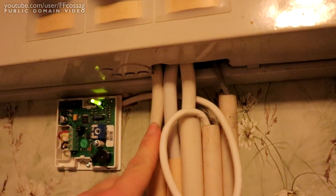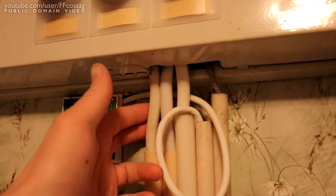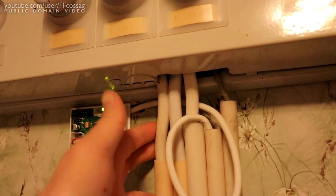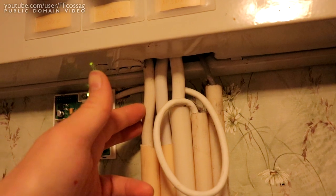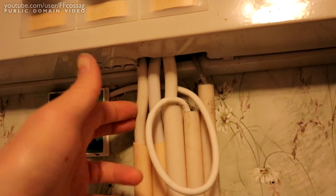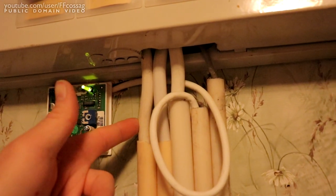And this guy is carrying two phases to exactly one light fixture and one outlet in the inverter room. And since we're going to be pulling three phase straight in there, that's going to be a small sub-central, we can just pull the function of this wire straight from that central in the basement instead. So we can just remove this one entirely.